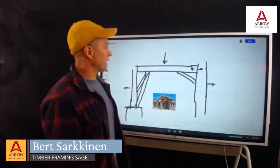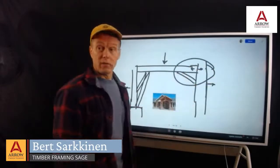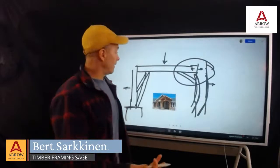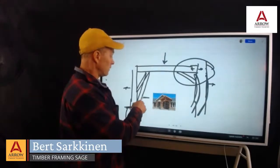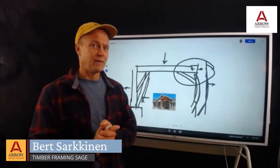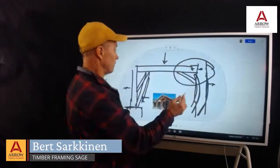So from the engineer's perspective, if he's going to validate what this knee brace does, he's got a lot of work to make sure this joint is going to hold together for it, as well as the post bending under load. So there's kind of a lot of moving pieces. And the best way to get an engineer to cut that down is to reduce the thrust, just like this here with that steep roof. Like that steep roof in the truss analogy. So I hope that helps. Go ahead and let me know if it's clear as mud or if you need more answers. Okay. All right. Thank you for the question, John.